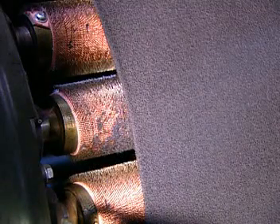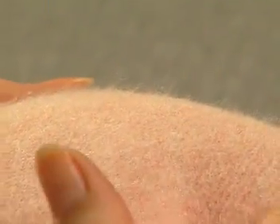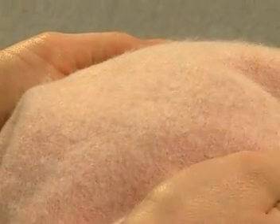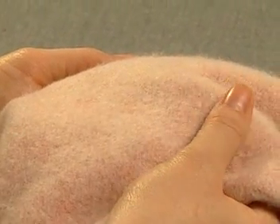Another common mechanical finishing method that appears to rip and tear at the surface, rather than cut, is napping. Napped fabric produces pile, a fabric effect where fibers are caused to protrude in a dense or high population on the surface. This imparts a feel that is pleasant and plush. To achieve this effect, the napping system employs up to thirty raising or worker rolls that are covered with wire points.